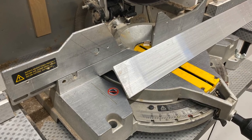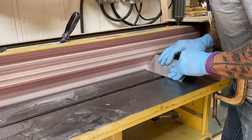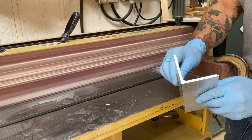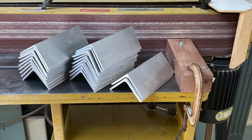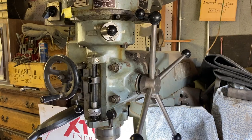On to cutting more aluminum at the chop saw, and then on to the edge sander to dress up the ends, using a 90-degree stop. I simply drilled and tapped my cast iron table to create that stop.